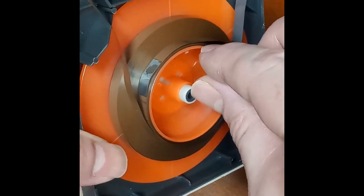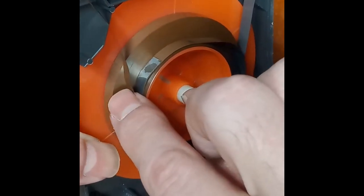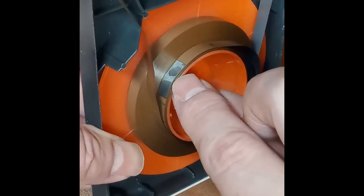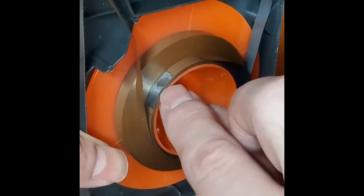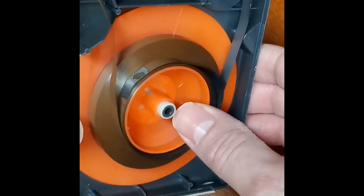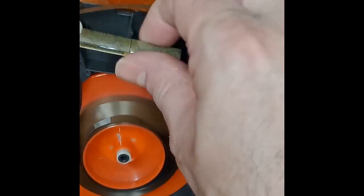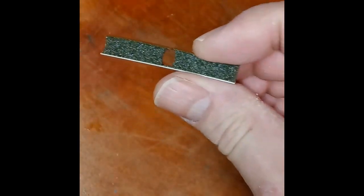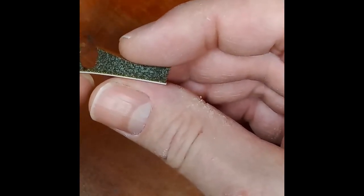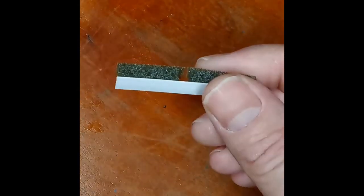This even happens with tapes that have been unsealed and played and just stored. But it's not uncommon for tape that's resting on top of the sensing foil to end up getting glued to it, just because of chemical changes in the foil, because this is aluminum. So again, doing maintenance to this, and these pads, instead of being gooey, I'm going to move this out of the way, these pads are dried out. And well, they're still a little gooey, but this is the kind also where it is going to make a gigantic mess if you were to pop it in as is and try to play it.